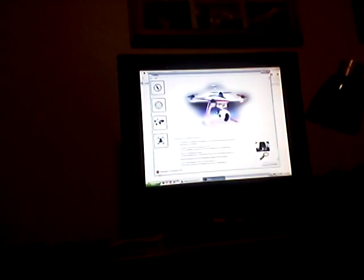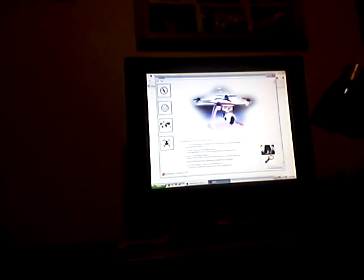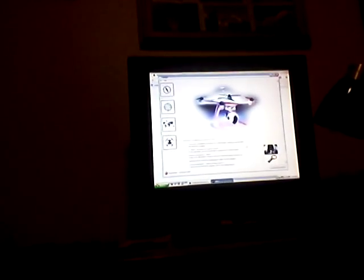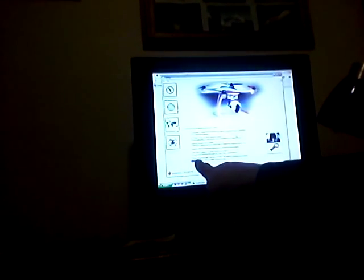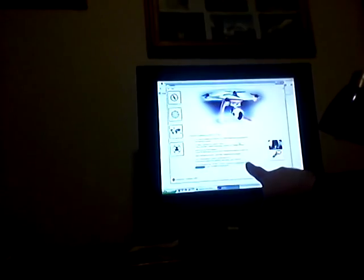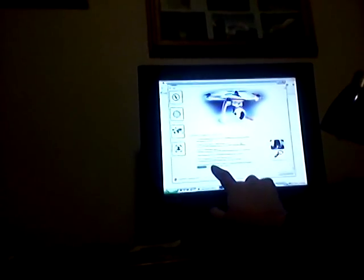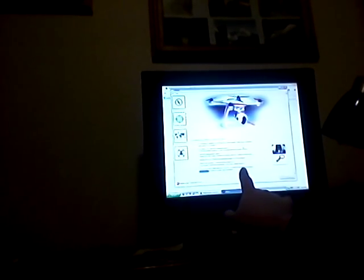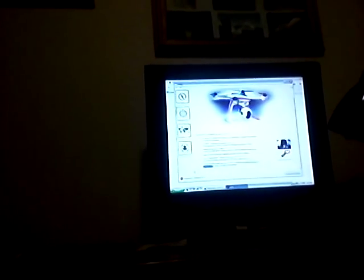Okay, so currently down in the bottom left corner it says disconnected, trying COM port 7. Okay, and that is the correct COM port. Now for all of you that need to find the new firmware, on this homepage, when you're not connected, scroll down. Item number 6 right here: if your firmware is older than November 1st, 2014, there's a hyperlink to download new firmware right there. You click that link to install the new firmware. A lot of guys were a little bit confused as to where, but it's right here.